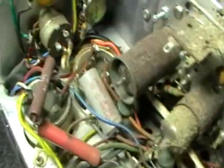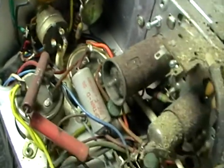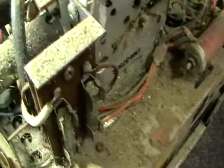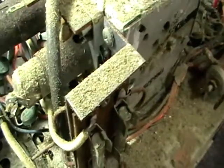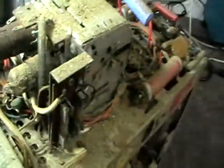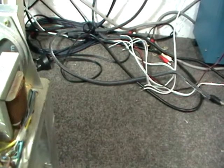So what have we got? Power supply caps there. Little power filter caps. Yeah, these oil-filled Japanese electrolytics, they'll all be shot. They'll be leaky as hell. Some of the few old Japanese valve amplifiers I've got, I'm sure you hi-fi guys would know these caps are generally leaky by now.